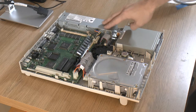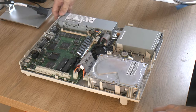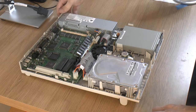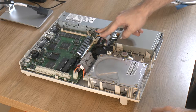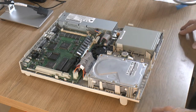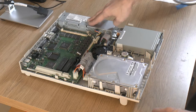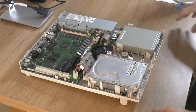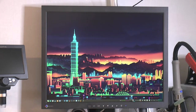When I got the system it was supposed to be working, but it was actually dead. On this system it's just a power switch at the back and that's your main power for the whole system to boot. That didn't work — it was completely dead. I checked the voltages and had nothing. This is supposed to be 5 volts, 12 volts and negative 5. There was nothing on any of them. So I have temporarily revived the power supply, and we'll get into what was wrong with it and what we're going to do to permanently fix it. Pretty much everything in this machine is in a state of decay.